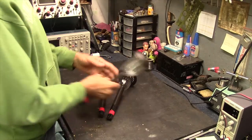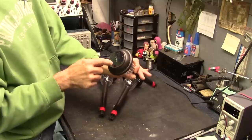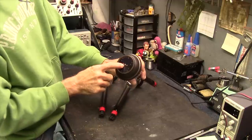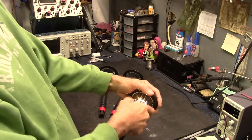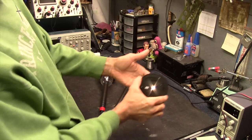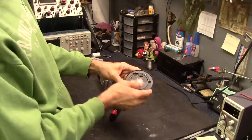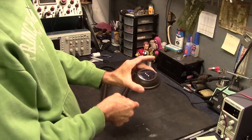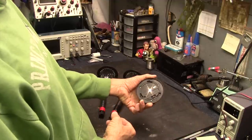That's where the yard lights come in. I picked up three of these at a hardware store. They've got a little solar panel on the top with four cells, and also a photo cell on the top that turns the thing on at sundown when it gets dark outside. These pull off just like this — a nice little module. As soon as it gets light, it goes out. Really simple circuit. But I'm thinking these are very hackable. We could open this up, see what's going on inside for circuitry, and see if we can put some of these together to make a neat little power pack.